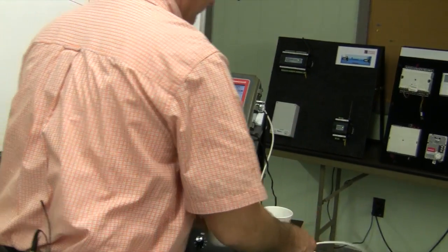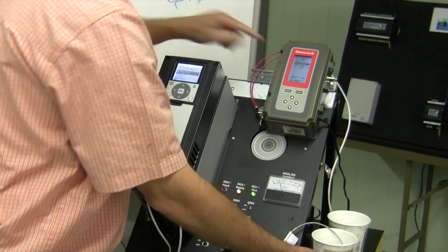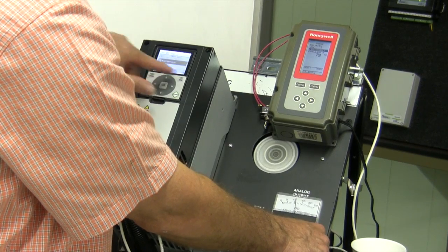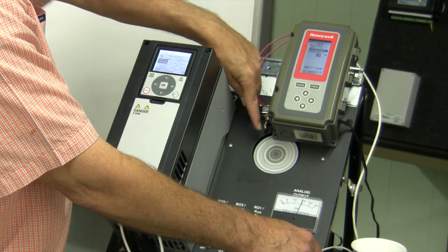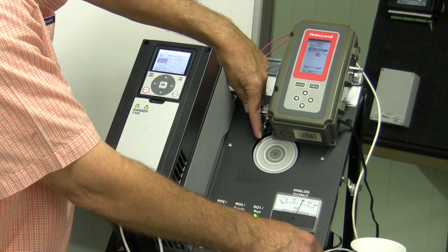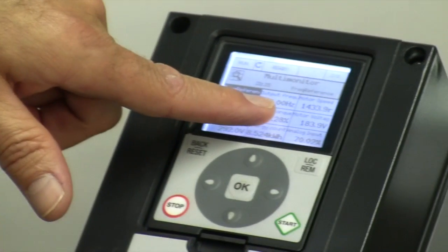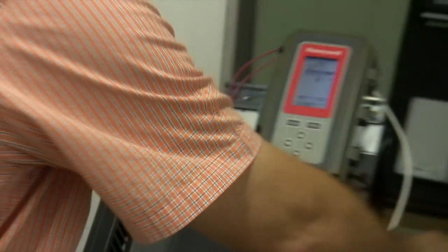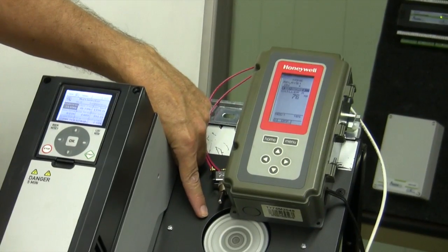All right, we warm it up. It's warmed up to 74 degrees now, 77, and you see as it gets warmer, our motor will spin a little bit faster. We're at 39 hertz, 43, and it's going to spin on up to 60 hertz to try to maintain set point. Ramping on up. Now, I can cool this water down. All right, temperature's dropping, fan speed is dropping.